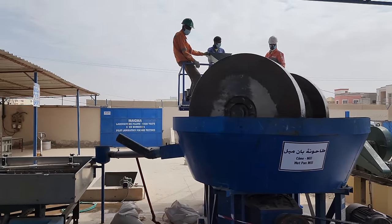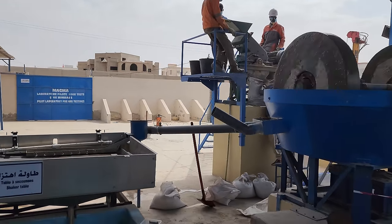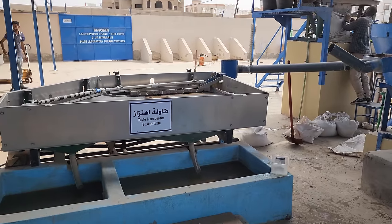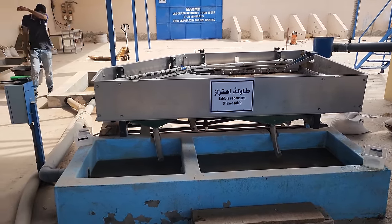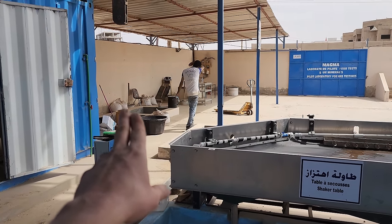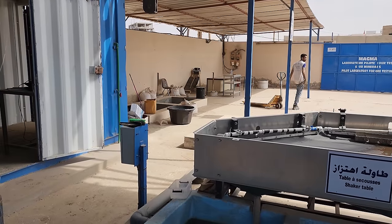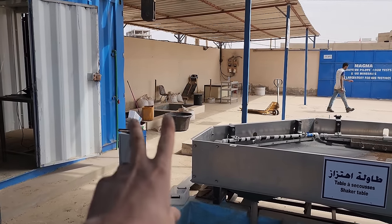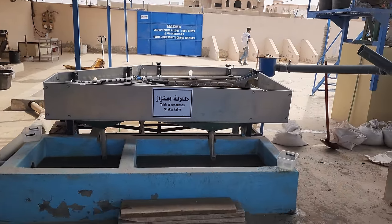The guys are finishing up crushing the rest of the stuff through the hammer mill, and we'll have two runs on the shaker table with cons for direct smelting, and we have two bags over here, two samples, one and two, for whole ore amalgamation back at Chami to test the recovery of the way the miners do it now versus the new system with direct smelting.